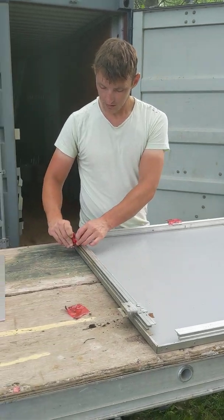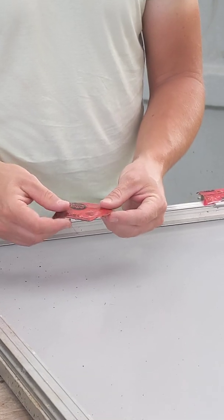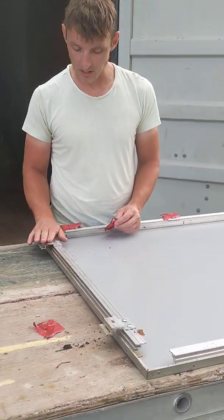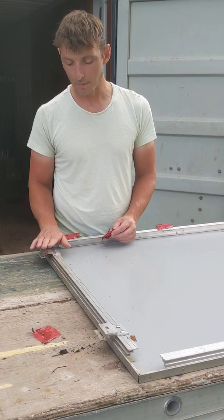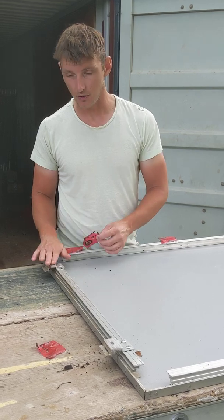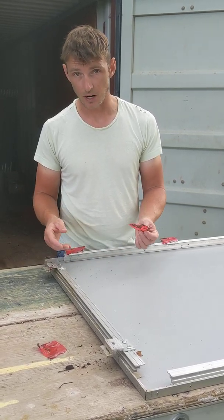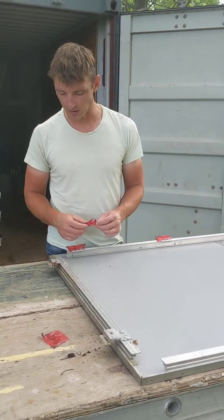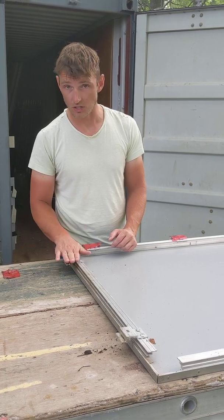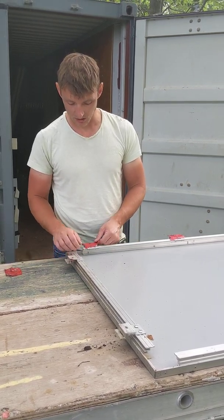This red tape — we put a tuck tape or a foam tape only when we're installing these aluminum clips on steel. We don't want any oxidization, so it's really important to put a barrier there if you're installing the panel on a piece of steel, like a steel Z-bar or a girt. If it's on wood, you don't need these. Or if you have a blue skin or something, you don't need these either. This is just if it's going direct onto steel.